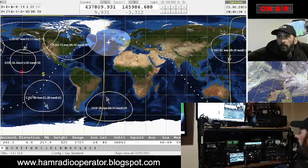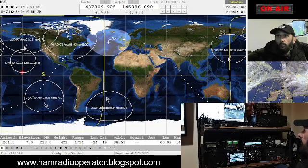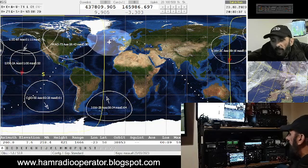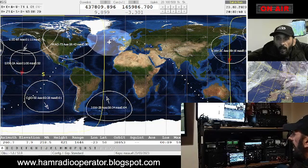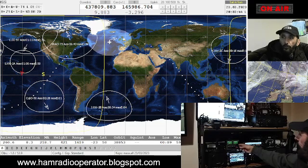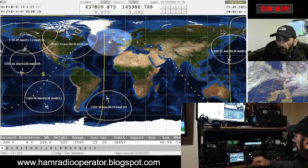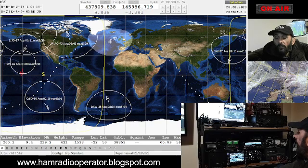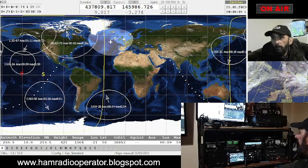It's going to be coming almost directly overhead, so it should be some reasonable elevation for the antennas to point up into the sky. I'm using the G5500 Yaesu azimuth and elevation rotator system, which you can see the control unit here on top of my main radio. That's hooked up via USB using a serial port connection, and it's the latest chipset to run on Windows 10. It seems to work quite well. We've been running it for quite a while, so it's just a case of being patient now.